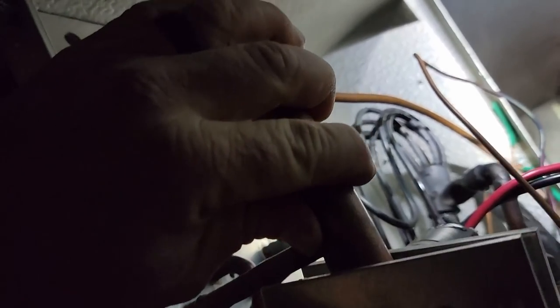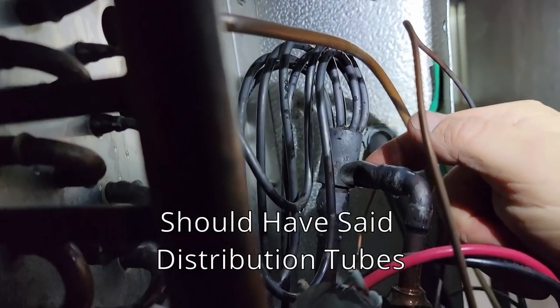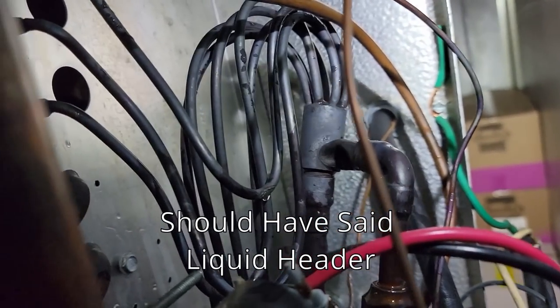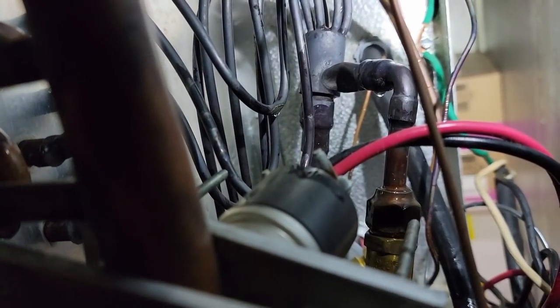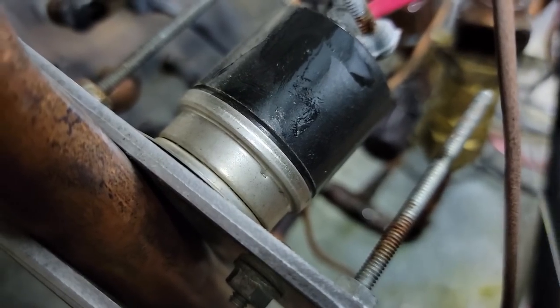So what we got right now — hot gas coming in through this suction header, which doesn't feel that hot. Coming through the TXV — they've got that sucker pinched down big time. That's warm. Oh — the check valve. Then back on the liquid line, that goes back to the liquid rack. It's kind of hard to see because there's so much stuff in the way back here. But trust me, it's not leaking. We got lucky. With that high pressure on it, if it was leaking you would see it plain as day. And it's not — which is great. Not often that you get a nice easy one like that.